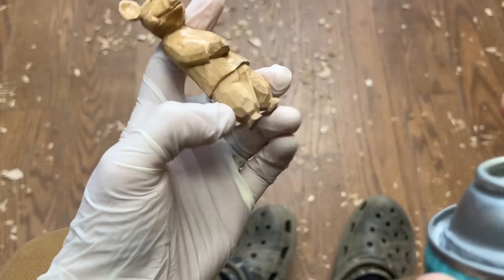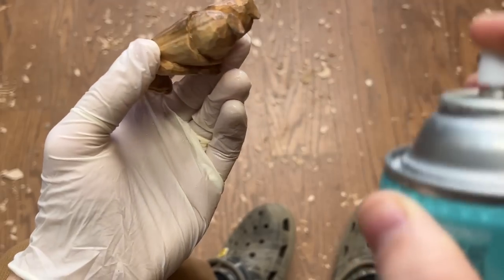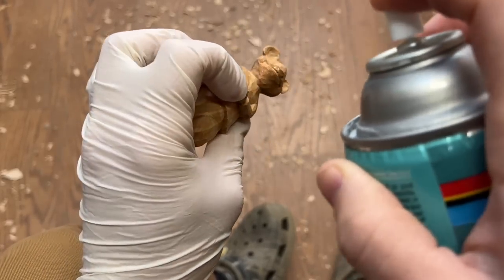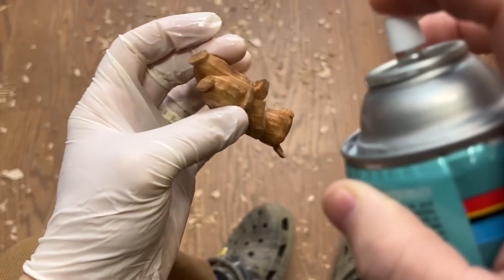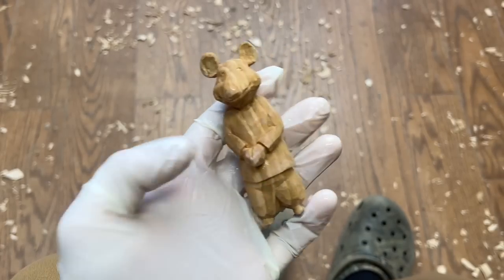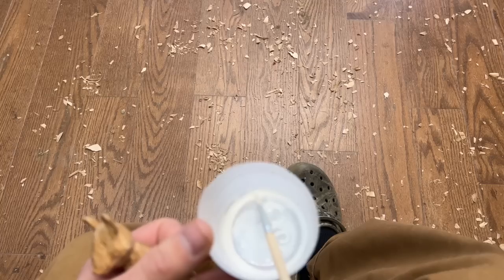And if it pools up in any spot, I can pretty easily just take a brush to it, get the excess out. Trying to get all the angles. Very good. And it's a dry wood, so it should absorb most of the finish. And look at that. Darkens up a little bit. It'll brighten up as it dries, just a touch. Let that dry. We'll come back to paint.